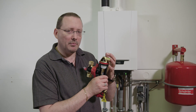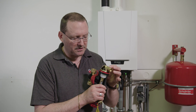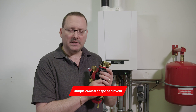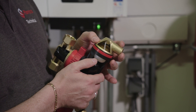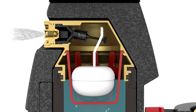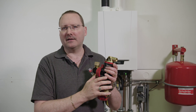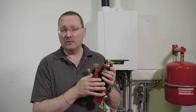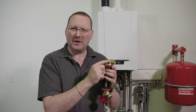The vent part — just the top part, the automatic air vent — what makes this particularly unique for Flamco and an efficient design is the conical shape of the vent. When the float is fully up and there's no air to be released, any floating debris that may have collected in this chamber is a good distance away from the automatic air vent itself, while still minimizing the amount of air above water. This means we're preventing more air becoming remixed with the water, which would generate corrosion, while guaranteeing we won't foul the air vent with debris that could cause a potential nuisance leakage.